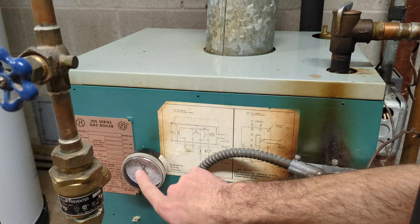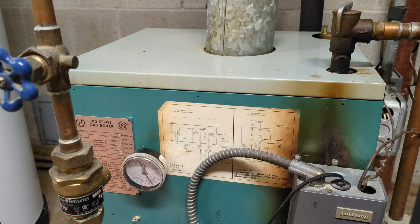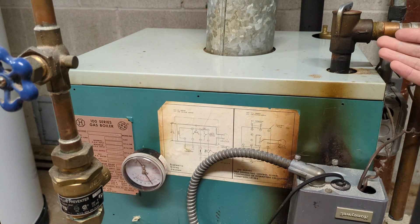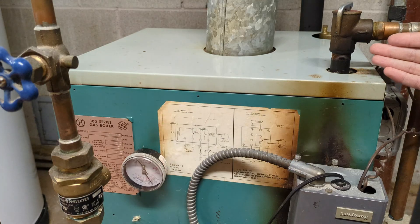So if you're monitoring pressure and it's not above 30 PSI on the gauge here, and your pressure relief valve is leaking water, then it's going to be caused by the pressure relief valve itself — because the water pressure in the system is below 30 PSI. That's the reason why the valve itself might be broken and leaking water.